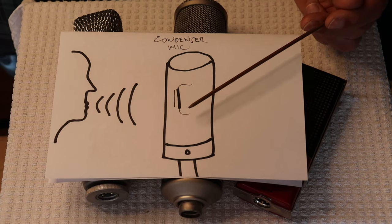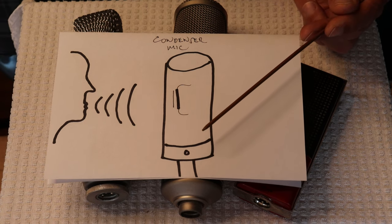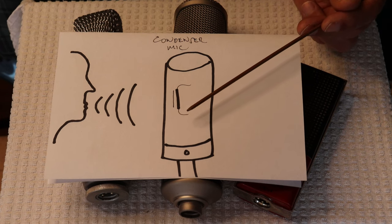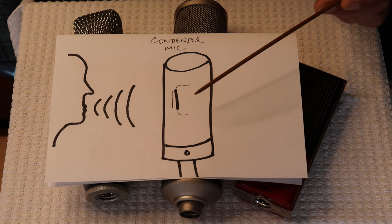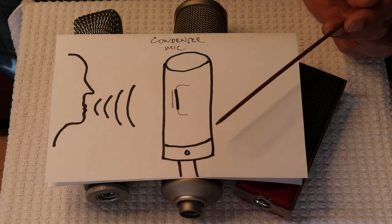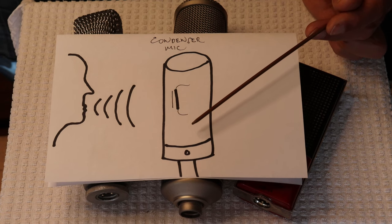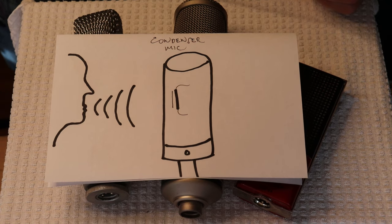You've probably got a fairly long cable run from the microphone to your mixer — maybe 20, 60, or more feet — and a very low signal, we're talking millivolts. That's not easy to move through a cable, so you apply gain to amplify that signal. You can do that with solid state electronics, or with a tube — or even a pair of tubes. Before solid state existed, it was all tubes if you wanted amplification.